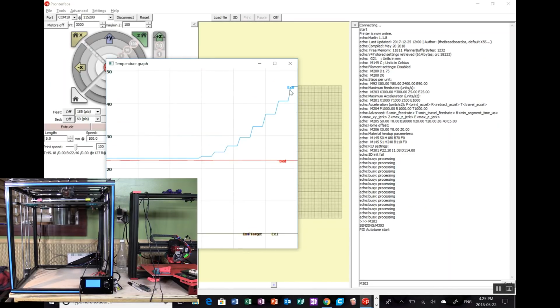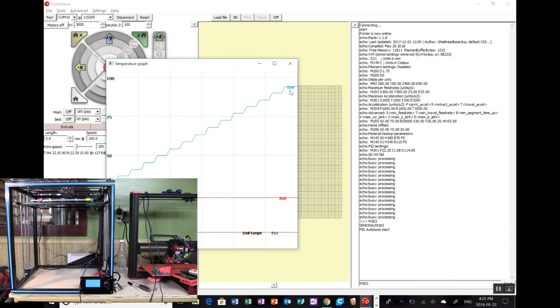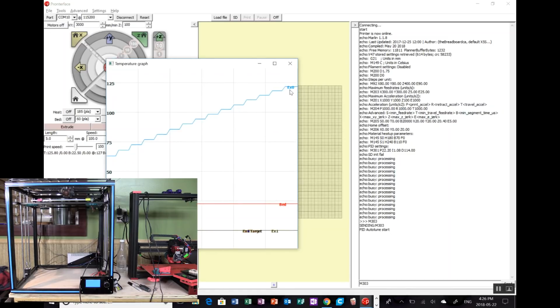So you can see here, you actually don't need an LCD display for a 3D printer. In fact, my CEL Robox printer that I've had for a couple of years now, or 3 years at least, does not have any LCD display at all. You drive it from the PC, but it can still run standalone as well. You upload the G-code to it and it will just run happily without the PC connected. But it has no displays at all for showing you what's going on. It relies on the PC program to control everything. And so for this printer, if we didn't have an LCD, it wouldn't be a big loss. But I really do want to have one on there because I want to be able to just control them independently.